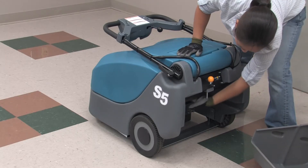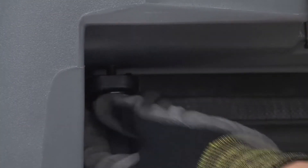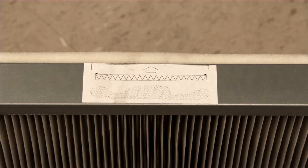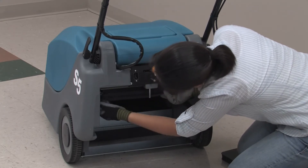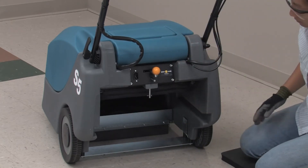While the hopper is out of the machine, you can inspect the dust filter. If the filter needs to be removed for cleaning or replacement, loosen the two filter retaining knobs on the rear corners of the filter assembly. Once the filter retaining knobs are loosened, you can lower the filter assembly and remove the filter from the filter retainer. Note: there is a decal on the filter showing the direction of airflow. The correct airflow direction is from the hopper, through the filter, and into the vacuum fan. It is important that you install the filter correctly with the arrow pointing up. After cleaning or replacing the filter, reverse the disassembly steps to install the dust filter assembly and secure it. Then reinstall the hopper.